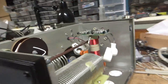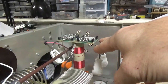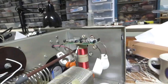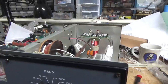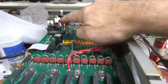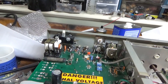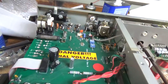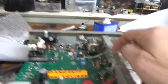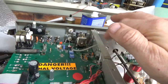Plate choke looks okay. Needs new straps — they are just shot, super frayed. I'll replace the straps. The board looks okay. It has the old cap mod that can come out; looks like it's about to pop. I'll add the gas discharge tubes below the socket. The soft start resistor is fried, so I'm guessing he had a bad tube. I'm going to turn it on with no tubes to make sure all the filter caps are okay. I'll change the new SO-239s and check the dynamic bias transistor — I've had a tube flashing, and it doesn't have the gas discharge tubes, so it's most likely damaged.